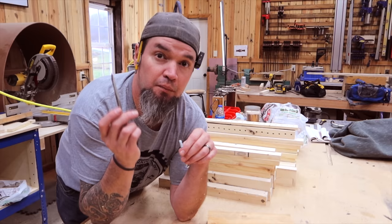There are several different ways you can cut these holes. You can use a drill guide jig — just note you will not be using a spade bit for that, only a regular drill bit. Or another option is one of these portable drill guides. What you can do is screw this down to your work surface, chuck a drill up into it, and essentially you have a mini drill press. These come in really handy for end pieces and things like that — they will not fit under a drill press if you have one. They're like 30 bucks — I'll throw a link in the description. The very first set I ever made, I used just a drill and a jig, but tools have come a long way. For this video I'm actually going to be using a drill press.